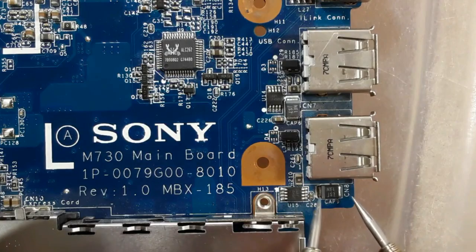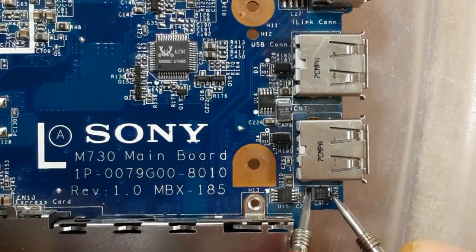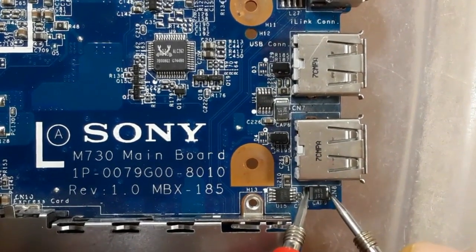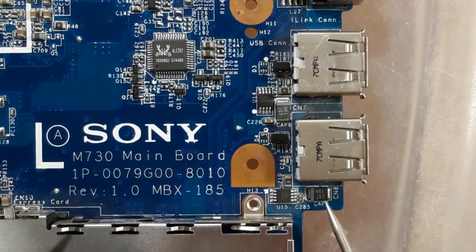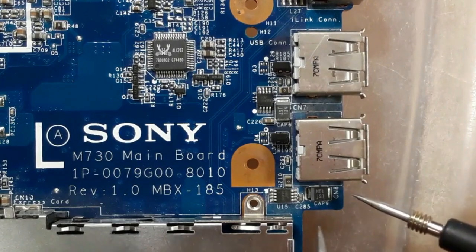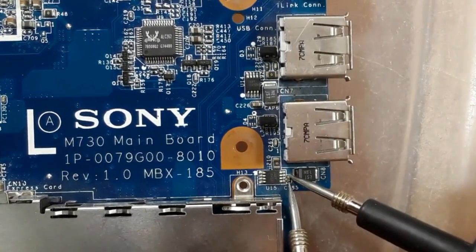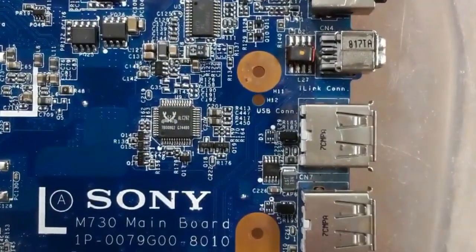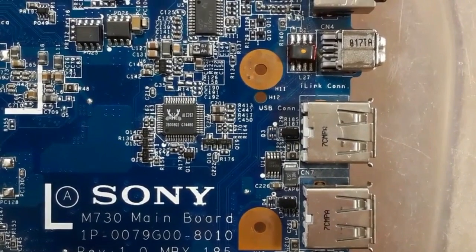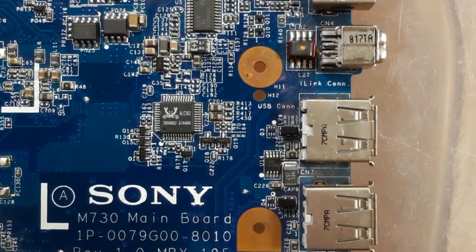Let's check also the chemical capacitor — the chemical capacitor is good. If you hear a buzzer, it means the chemical capacitor is shorted to the ground, so good means no buzzer here. Here we have the IC. Let's check this PF capacitor — the PF capacitor is good, which means the IC also is good. The second fuse is also good.